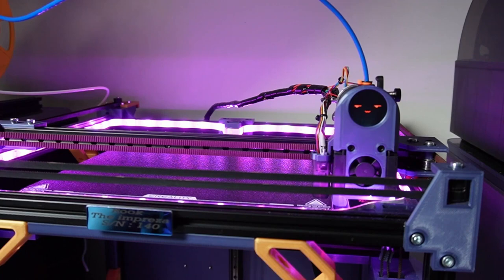Which is pretty good. It still has to be dialed in. The flow rate is now at 1.5 for doing that first layer. So we have to do pressure advance. It hasn't been done yet. And the machine also has to do input shaping, which also needs to be done. But we are waiting for parts so that we can also assemble it in front of the dragon burner.